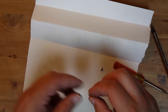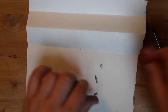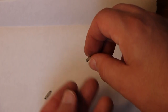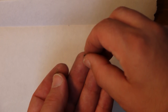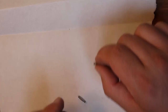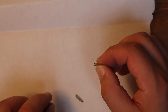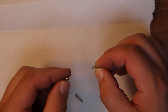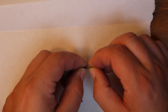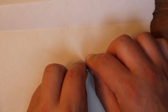So we have one key pin, one driver pin, and one spring. Going to go close up here and show you exactly how they interlock with one another. The very small notch cut out of the key pin corresponds to the very small peg sticking out of the driver pin. And when they are assembled, the chisel-tipped pin has to be both lifted and rotated in order to decouple these two.